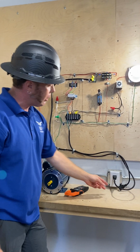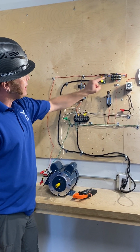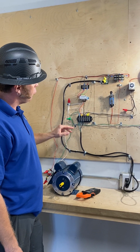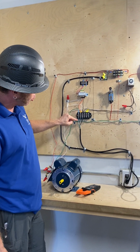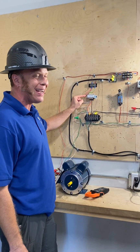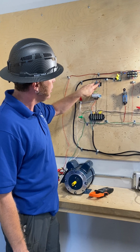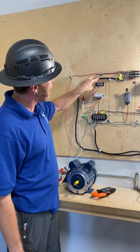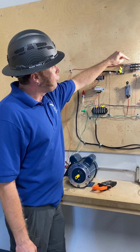So therefore, now I will take my second whip, which is my contactor and ultimately my contactor to my motor, excuse me. So my power is running up 120 volts to my 600 volt terminal block, spliced accordingly opposite of the connections. Always pay attention to that. Coming up to my step down transformer, 120 volts to 24 volts. My 24 volts out to my 300 volt low voltage terminal block. From there I have a line that goes to my relay and another line that powers my contactor.